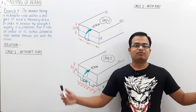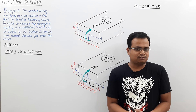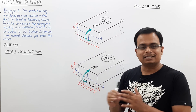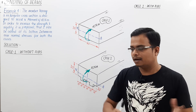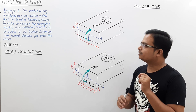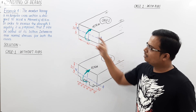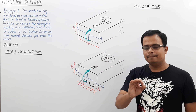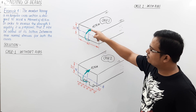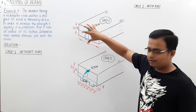Hi everyone, this is Vanas, your friend Natyuta. Today is probably the last video in this series on bending of beams — this is the fourth and final example I'm going to take up. Let's read the problem and see what it has in store. We've got a member having a rectangular cross-section, 60 by 30 mm, and it has been designed precisely to resist a moment of 40 Newton meter.